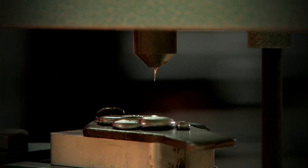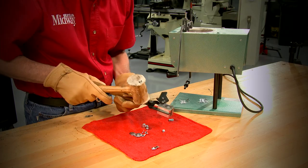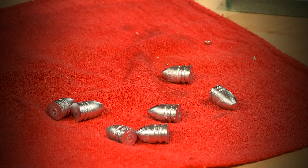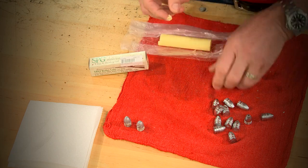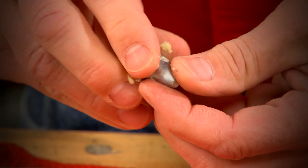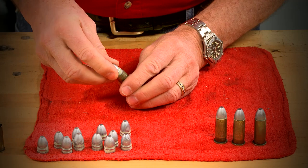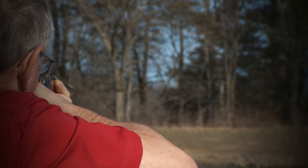It takes only a few seconds for the lead to harden, then a mallet is used to knock over the sprue plate which cuts off the excess lead even with the base. Bullets from the modified mold come out at about 360 grains. For testing I'm simply going to lube them with my fingers, then I can prime the cases, pour in 45 grains of black powder from a brass dipper, and seat the bullets by hand — and no surprise, it shoots just fine.